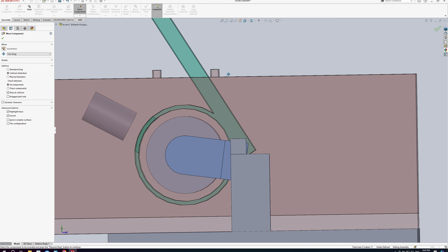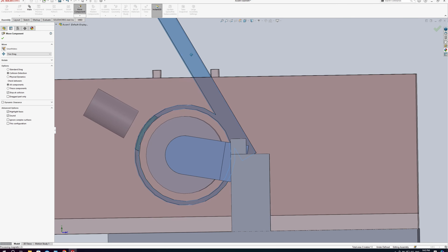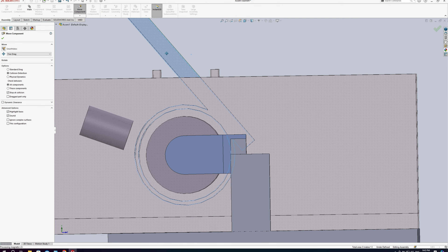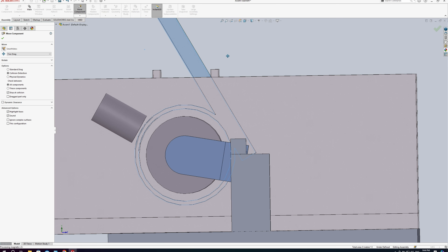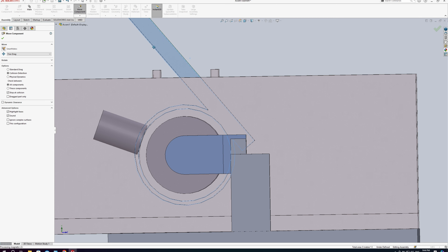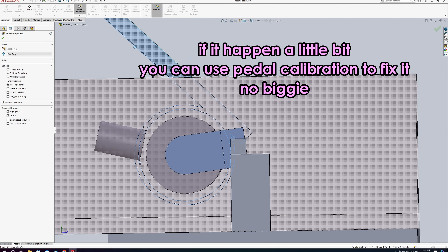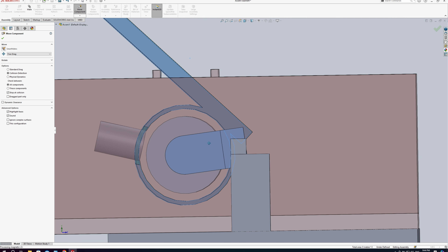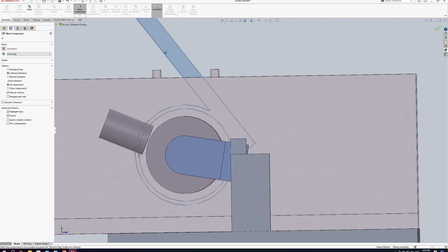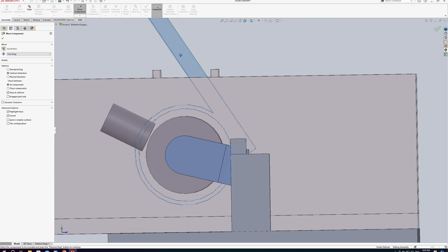Another thing to watch out for when correcting the magnet position: when the pedal is not pressed and you press all the way, if the magnet is too close the value will peak at the halfway point. The value you need is for the magnet to be at its closest when you press the pedal all the way down — not halfway. So this is how to fix it: higher resolution and no dead zone threshold at all.